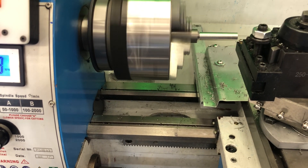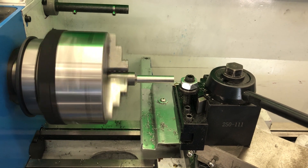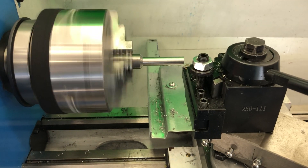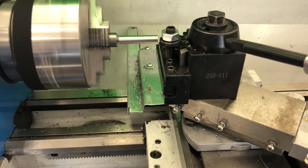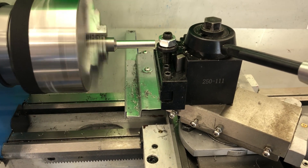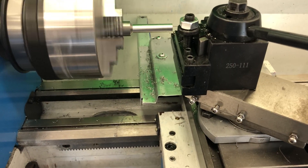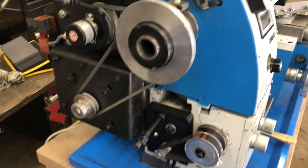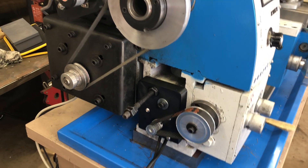Under load and all that, I've done quite a few tests for both metric and imperial screw threading and had no issues whatsoever. I did have some trouble because I was pulling the wrong lever during my threading test, but that was operator error. It seems to work well — I'm pretty happy with it. We got rid of all the greasy, gooey parts that were back here, and I may have to do just a little bit more cleanup before I cap it all up.